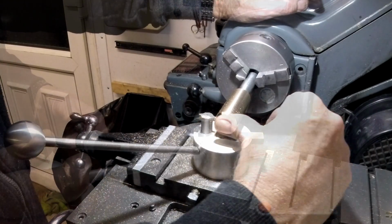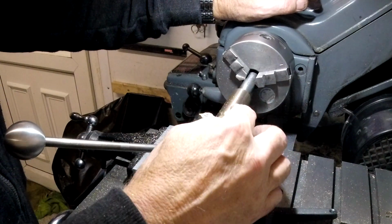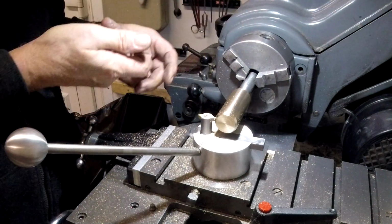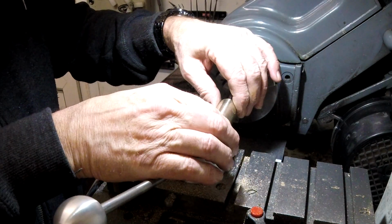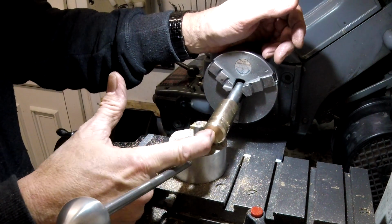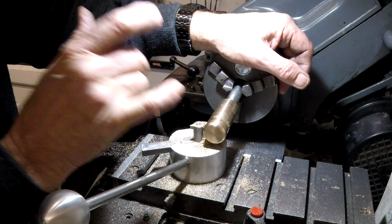I guess that's enough for the hammer face, isn't it? You don't want to be too small. It's only a tapping stick. Alright, I'll start making my shapes in here then. So I need to turn all this down, turn it all round now to make it into a radius cutter. Because the mandrel's not stable enough. I mean, does that tell me I need to drill a little centre in there and bring a centre in to steady it? I can always fettle that out afterwards if I don't go deep. Give that a try.